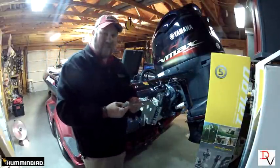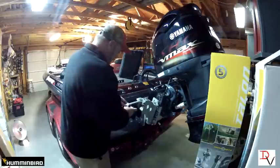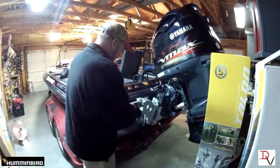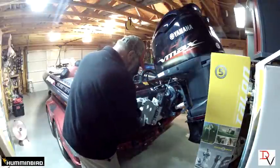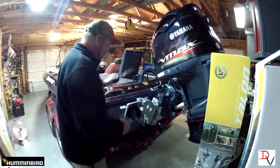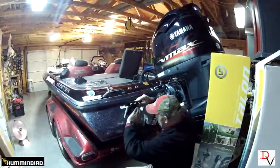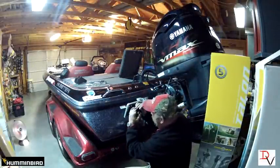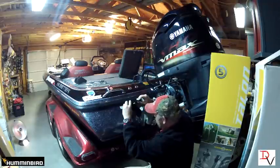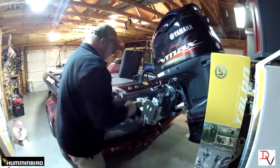The next thing is it's going to require a half-inch box end wrench and a ratchet with a half-inch socket. Just get these snug because we're going to have to level this up for the 360. I've checked the levelness of the boat and it's dead on. We're going to take our level and level our bracket — right in the middle. Then finish snugging them down.